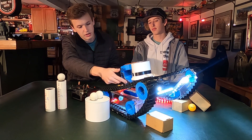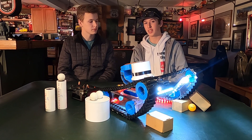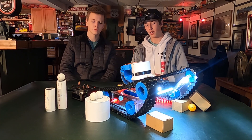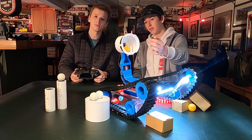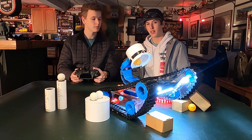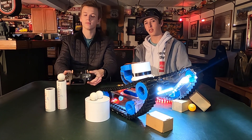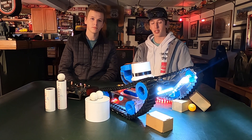We also added a small plexiglass wall to add to the structural rigidity. The capture unit itself is a carefully tuned model of creativity. Instead of opting for one of the more common capture units seen in Rescue Robot, like a vacuum or grabber claw, we created a bucket equipped with a one-way gate for ping pong balls. When the capture unit falls onto a drop pylon, the ping pong ball is forced through two tensioned rubber bands, which also keep the ping pong ball from exiting the bucket. Our solution for dropping off the ping pong balls is a servo equipped with wires capable of dropping them gently onto the drop pylon. The bucket is also designed with geometry to fit around the 4 inch drop pylon perfectly, so we can rapidly and precisely deploy the captured devices.